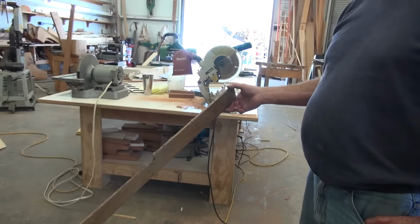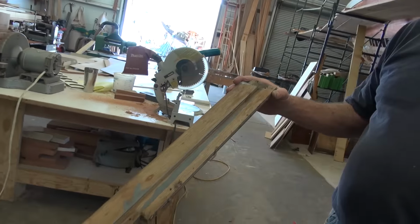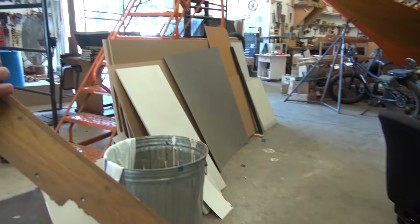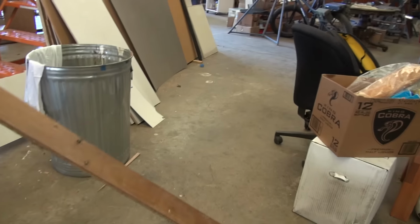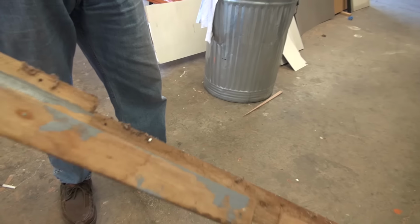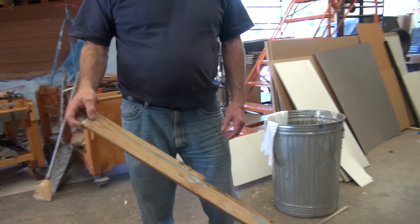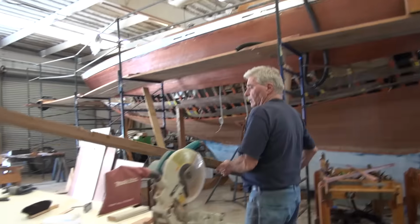On the air for a final epilogue, Doug wanted to show us something here. Isn't that nice? Now, this says port bunk. Yeah, this goes in the little plywood lids fit on here. Oh, okay, great. This is from the saloon. So they didn't glue it, they just used these little tiny screws and zero sealer of any description underneath. Now this is what was holding the cushion on? The cushion platform. Yeah, so this is the cleat, the whole cleat rig. It holds the lid on. Wow, pretty flimsy.